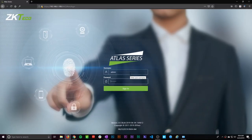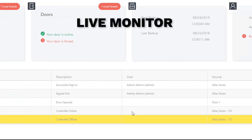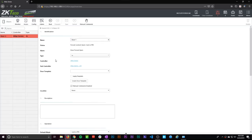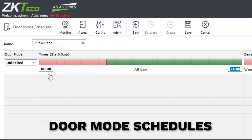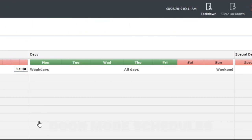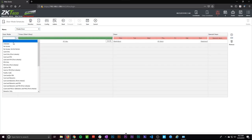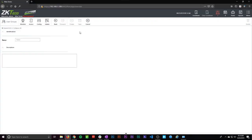We need to go and configure everything in the built-in web application. From there we can add users, set up locking schedules, and do a whole bunch of other stuff. Here we have the web-based interface. Once you log in, you'll see the main screen. This dashboard has a live monitor with all these alerts so that at a quick glance you can see everything going on with your system. Here's our tech room door with all the default settings. Let's set up some door mode schedules. First, let's make a public door, which we could use for any doors our customers might use — these doors we'll leave unlocked Monday through Friday, 8 to 5. Next, I'll make a private door where only people with proximity cards or a PIN will be able to access this door, accessible Monday through Friday between 6 a.m. and 7 p.m. Now we have our door ready to go.